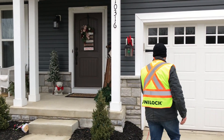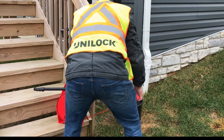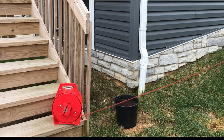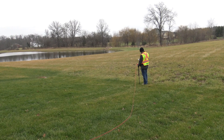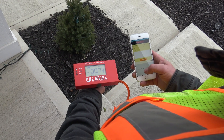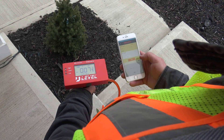U-Level is a powerful instrument for recording elevations so you can accurately plan your project. Always rest the U-Level spool on a stable flat surface. Locate the spool in the center of your working area so that you'll have a 100-foot working radius in all directions. Always take readings of elevations that will help you make accurate calculations for steps, landings, and patios.